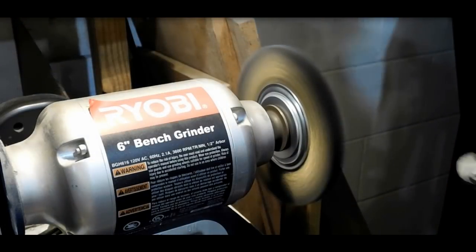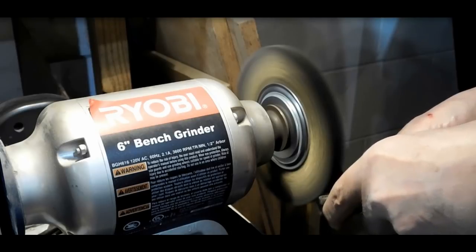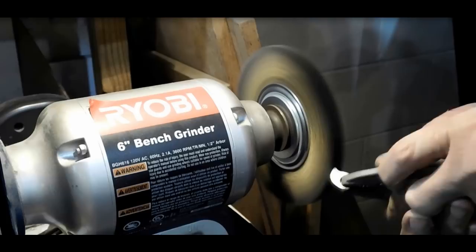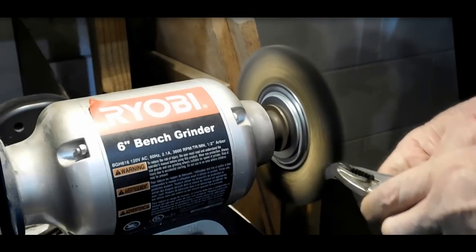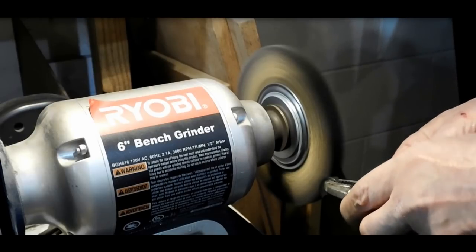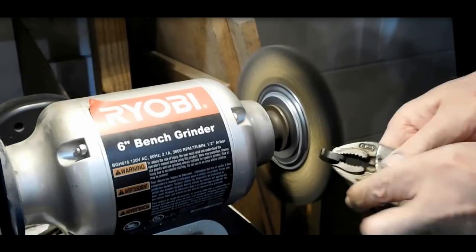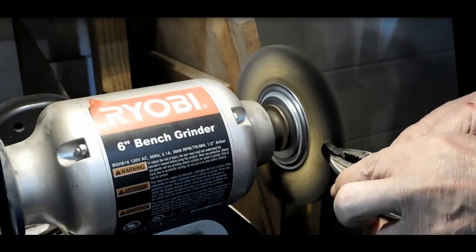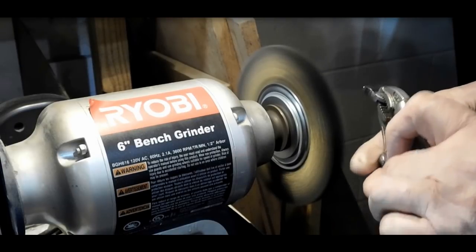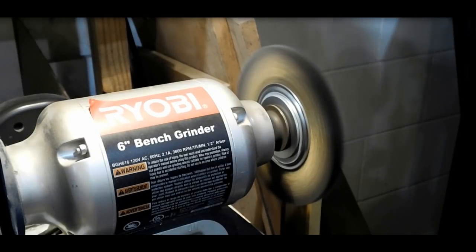Alright, I like to use a fine brass wheel to clean up my parts when I'm done. Works really well on steel. And this part's done for now. It's getting cleaned up, and I made it an 1/8 inch oversized because when I do the timing of the machine at the end when I'm getting ready to run it, I file down the tip a little bit until I get the two clicks in time with each other so that they work correctly. And then I'll be taking it over and case hardening it. That'll be a little later on.